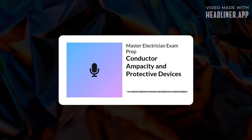Example. Sure. So you have a copper bus bar that's 4 inches wide and half an inch thick. Okay, 4 by 0.5 inches. Cross-sectional area is 4 times 0.5, which is 2 square inches. If we use the 1,000 amps per square inch rule, that bus bar could potentially handle 2 times 1,000, or 2,000 amps. Wow. Big capacity. Yeah, they're designed for heavy lifting, electrically speaking. Conditions like enclosure and cooling matter too, but that gives you the basic idea.